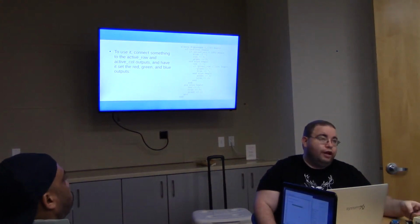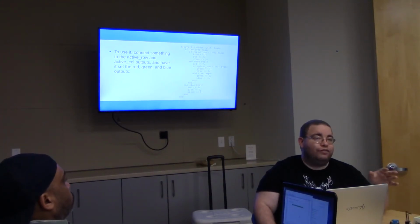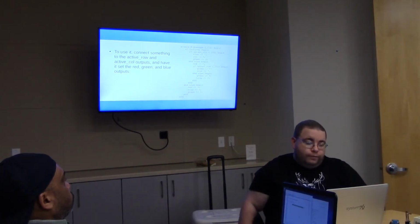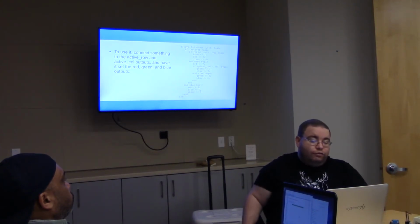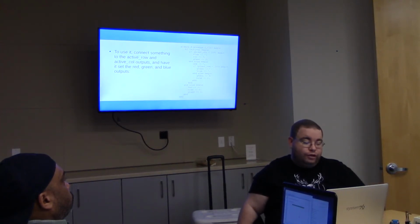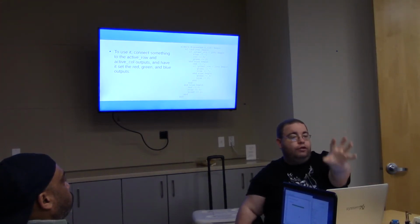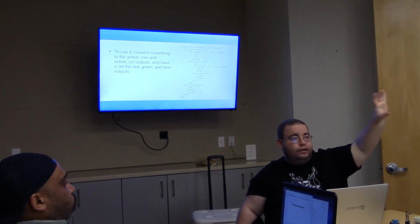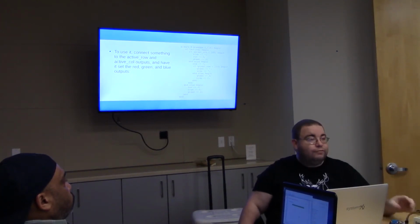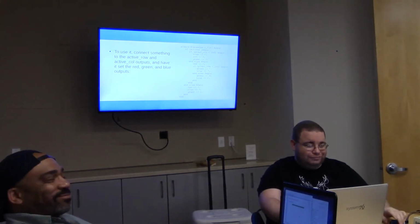Well, one of the things the VGA requires is that when you're not drawing, then R, G, and B all have 0 volts. It's a calibration thing so you can figure out what the voltage range is. But if you are active, then if the column's less than 200, then you make it all blue. Otherwise, you make it either all white or all red. And so you end up with a blue column on the left side of the screen, and then a white bar and a red bar. And I was not going to draw a star in Verilog.